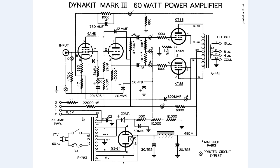There is a 6.3 volt AC output from the power transformer that heats up the heater filaments for both of the other tubes. It doesn't show clearly on the schematic, but that's what this 6.3 volts AC does.